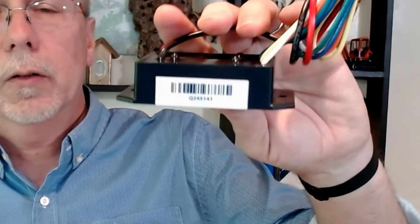There's also a missing component compared to conventional wire: you need a bicoder or decoder in the system. These devices take information from the controller and interpret it. Each one has a unique serial number — for example, Q245141. When connected, the controller sends a signal down the wire looking for serial number 141. As it travels the entire energized wire path, each decoder is asked: 'Are you 141?' — until the right one responds, opens the zone, and reports back. That's why they're called bicoders: they're bi-directional.